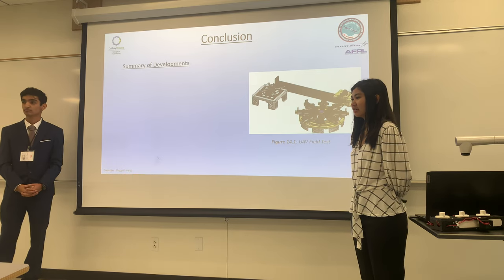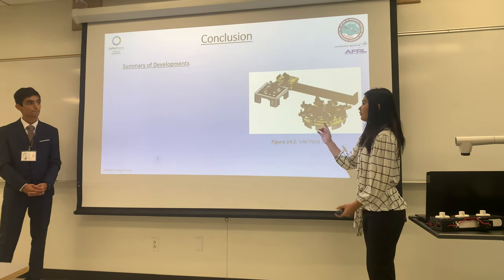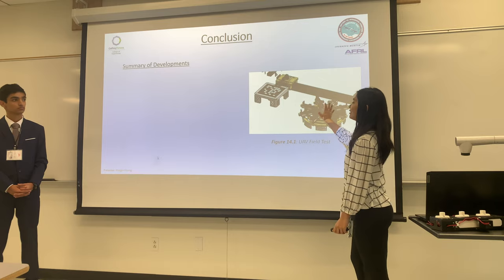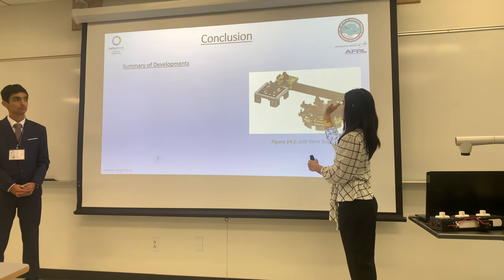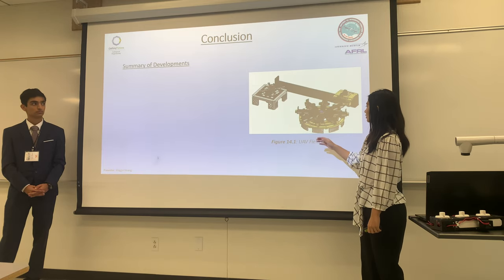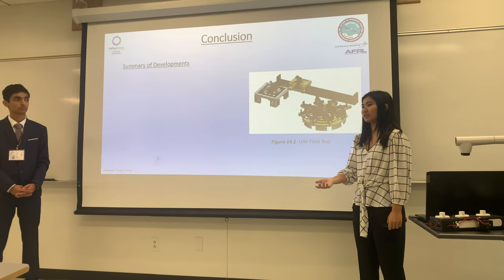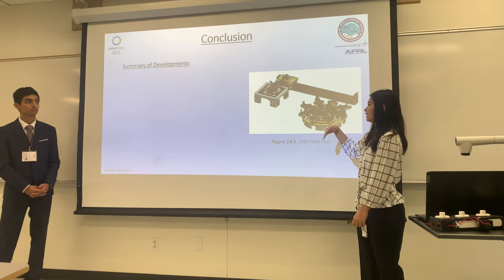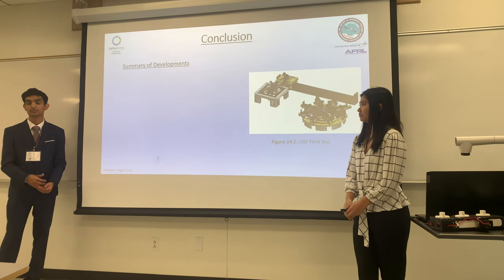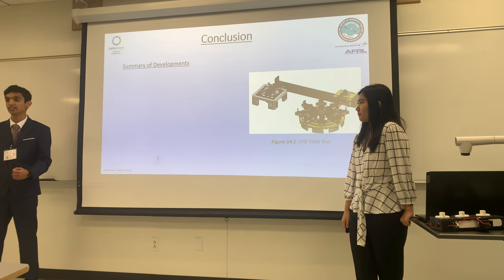Question: With the rotational mechanism, do you have something in place to deal with wires twisting? Yes, that's a really good point. We switched to a wireless connection for the BMS, but there are still some wires. The battery vending machine actually only rotates halfway — 180 degrees — in each direction, using the NEMA 23 stepper motor for precise positioning, specifically to avoid wire tangling. Previously we had it rotate fully and back, which caused cable tangling, so we fixed it by limiting rotation to 180 degrees per side. We may also add a coupler at some point for the wires, but for now we keep it between zero and 360 degrees to manage rotation.